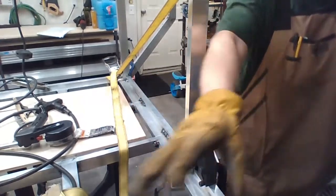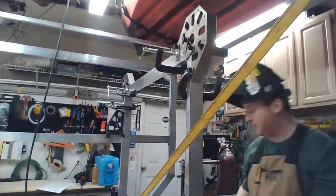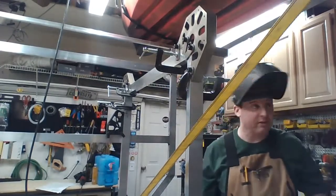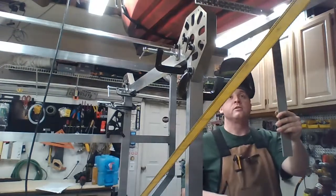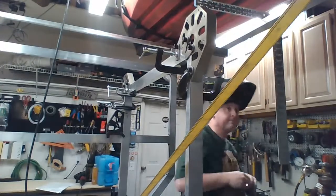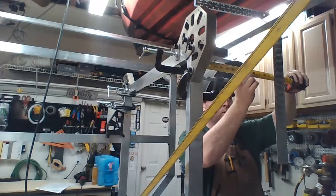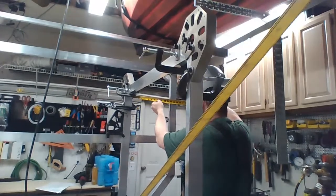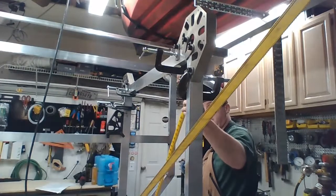One last check since I'm now 3 out of my 4 corners welded. Recheck this guy out here. And yeah, I mean it. I gotta recheck this guy because I'm not using super duper clamping forces, and you gotta fight distortion while you're welding. That's the only thing you're fighting, really. Woo! I like that number. That matches that number. I'll pat myself on the back.